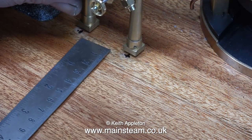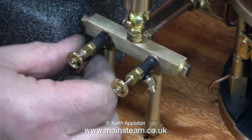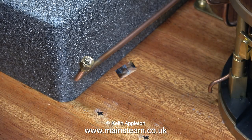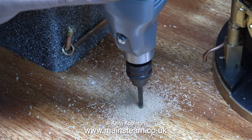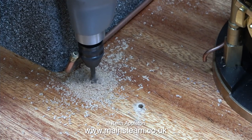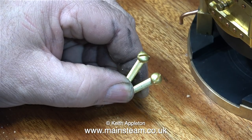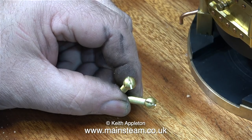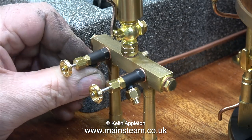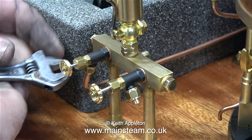The time has come to mount the turret onto the baseboard, so I'm using the rule of measure twice and drill once. I'm temporarily disconnecting the turret from the piping so I can move it out of the way. All I have to do is drill a couple of pilot holes on the black crosses — this is a 1/8th of an inch diameter drill bit in my Proxxon motor tool. Here are a couple of brass 2BA bolts which I'm going to use from underneath the baseboard to hold the turret in place. I had to drill upwards from underneath to enlarge the pilot holes, then counter-bore them using a larger drill because the bolts weren't long enough to go all the way through the baseboard.